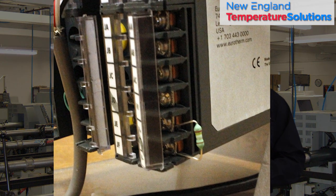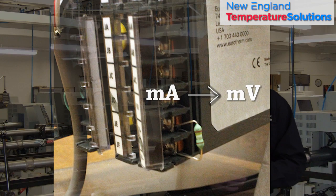Linear inputs of 0-10V DC or 4-20mA can be selected. When using the 4-20mA inputs, a shunt resistor is used across the terminals to convert the 4-20mA to a millivolt input. When configuring Eurotherm, the calculation is done for you if you use our resistor.